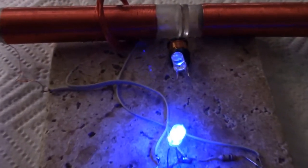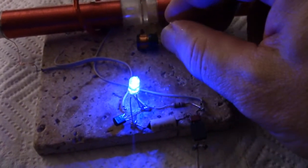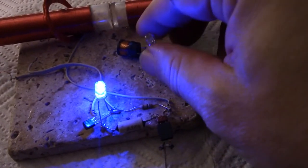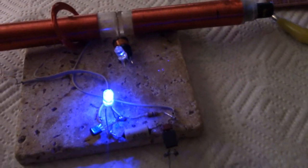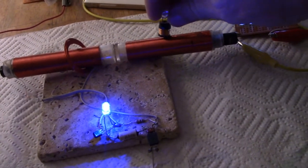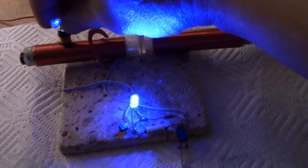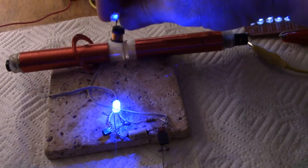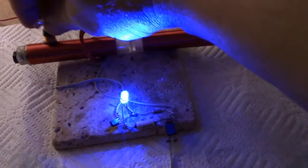What I forgot to mention before was this — I've just put it back in place a little bit better. This is just a regular coil; I haven't touched it in any way, just took it off an old junker board and put an LED over it. This lights up in between the two coils. It was also noted by WaveWatcher123 that you do get a wireless field — a wireless output — all the way along the coil, which is another difference from a traditional Slayer, where normally you just get it right at the very top. With this one it's all the way along.